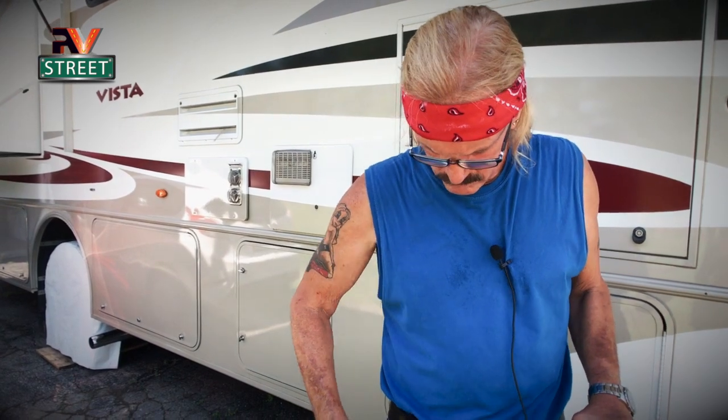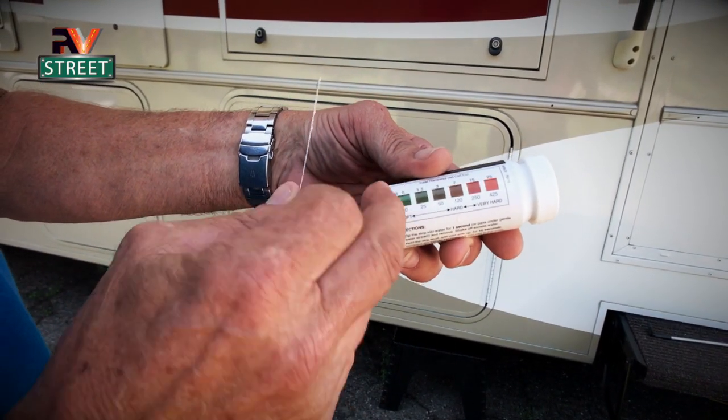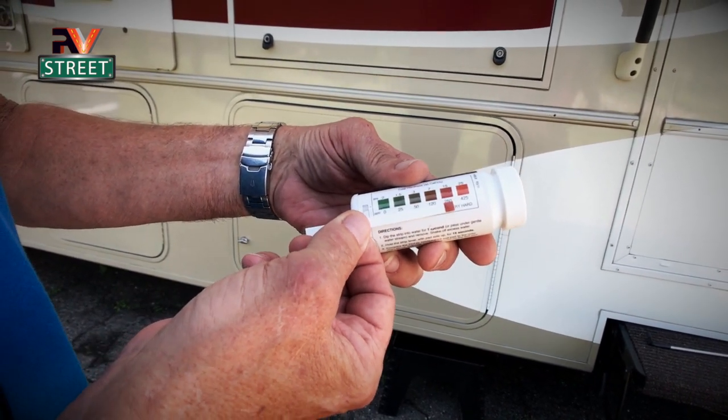Okay, let's get right to it. So how do you know when the water softener needs to be regenerated? Well, you test the water. We carry with us some test strips — in this bottle you have a bunch of these. You take a test strip and you dip it in the water, pull it out, and you can see right there it needs to be way down here, but look where it is — it's way up here in the 250 margin. That means the water softener needs to be regenerated. When you have high hardness like this, this is what causes buildup — calcium magnesium buildup deposits on your water heater, in your appliances, and your plumbing lines.